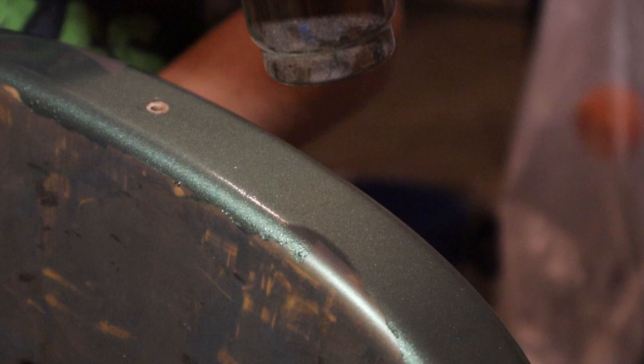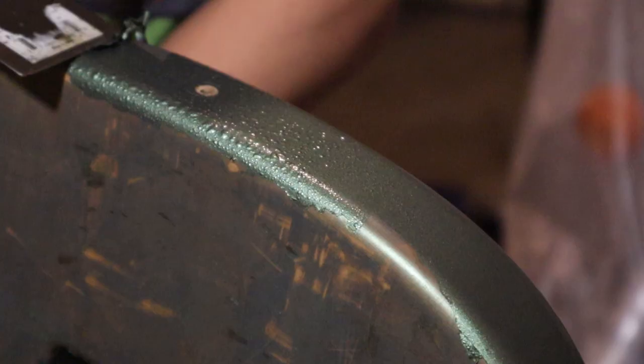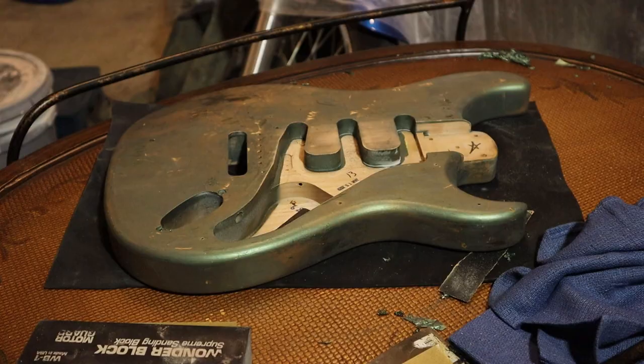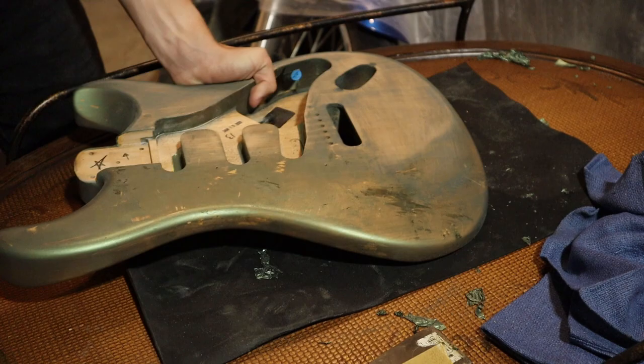There's a bit of a science to what I was doing. I would heat it up to the point where I saw it boil and bubble, as you can see here, and then I would strip it off, and it came off no problem. For this guitar, the heat gun did not take it all the way down to bare wood. It just took off the plastic poly top.